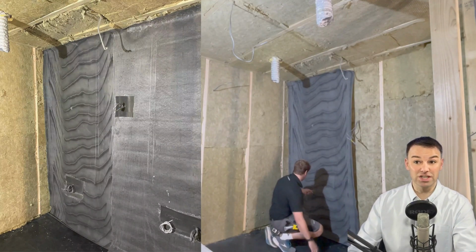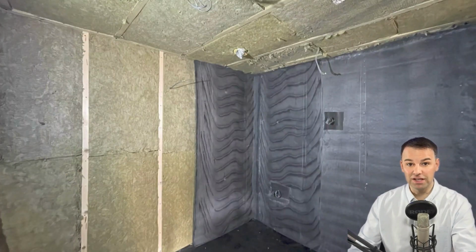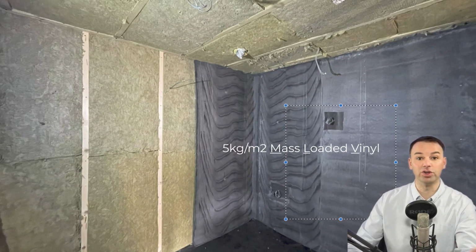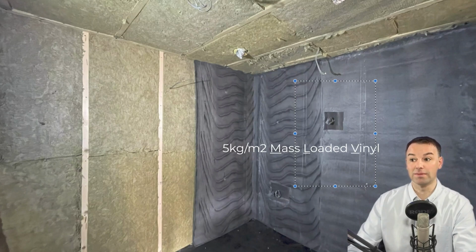So that's something you'll see from a lot of my videos. It's a combination that we've been using for nearly 15 years now, and it's one that we will continue to use, but it's got to be a 5 kg. Don't try and upgrade this with a 10 kg because you'll find that you might channel the noise into other areas. So it's got to be that 5 kg per meter squared mass loaded vinyl.